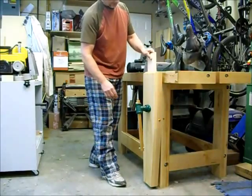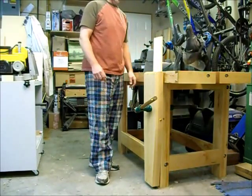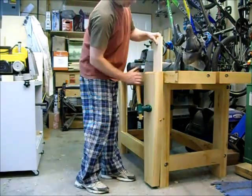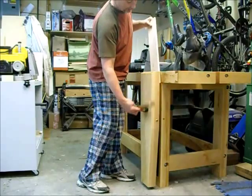If you're looking for a bench that's got a vise with a lot of power in it — this board is just a piece of spruce, I split it right down the middle and put it in place. But if you were to want to do some dovetailing on something that's relatively tall, this is 10 inches from the top of the chop to the top of the screw.